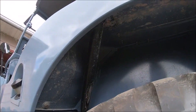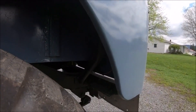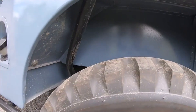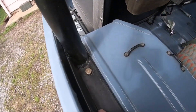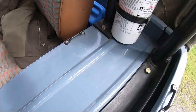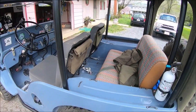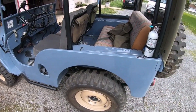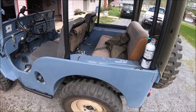Pretty much stays on here all the time and we love it. It's great protection from the sun and elements and it gives it a pretty cool look. It does tie into the frame in four different spots with the same tubing, and I have brace pads on the frame as well. It's welded down there and bolted, sandwiched with rubber on both sides, so you can take off the bolts and remove the cage. Then the body and the frame braces will remain — it's not welded in directly.